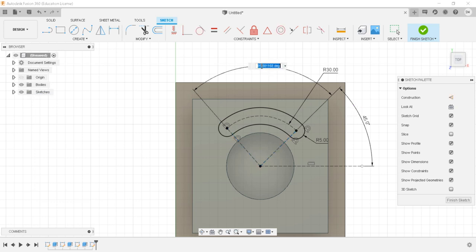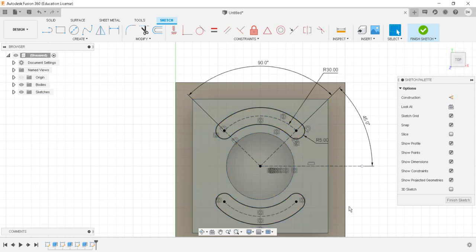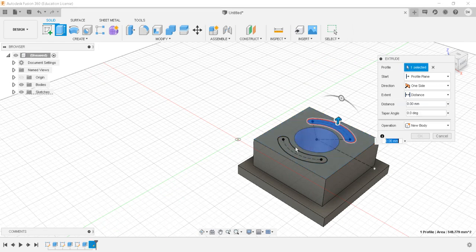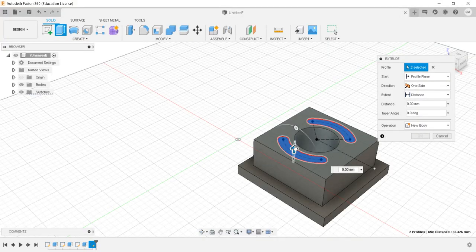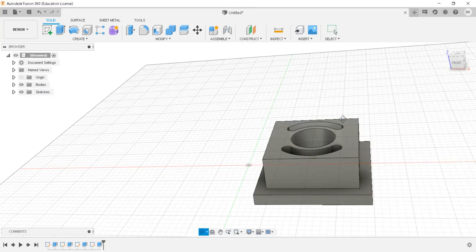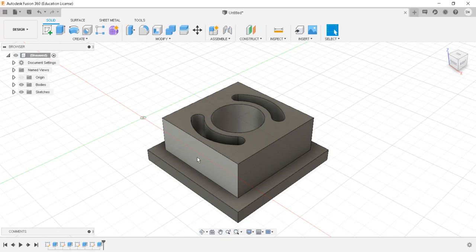The arc angle is 45 and the other angle is 90. That completely confirms the dimensions. Now I'll mirror this slot — selecting the relevant entities and mirroring about the center line, say okay. So we have created these two slots. I'll finish the sketch and carry out the extrude cut operation this time by amount minus 20. Now we will move into the manufacturing environment.